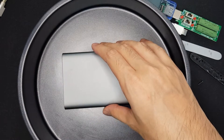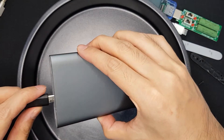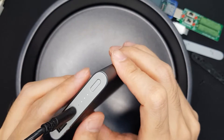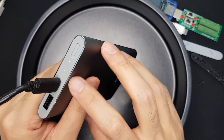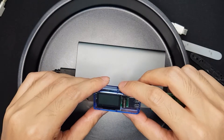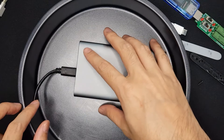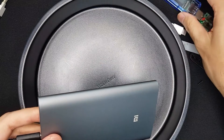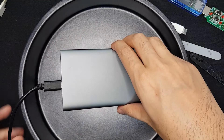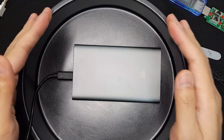This is my test setup. First I'll recharge the cell to its fully charged state. The cell is now charging. Since we don't know the current state of charge, I'll fully charge it, then discharge it using the monitor and load, and measure the capacity. I'll then recharge it and see how much charge goes in. The explosion container is in use throughout so any explosion would be contained.